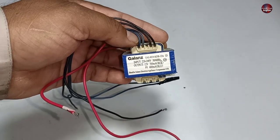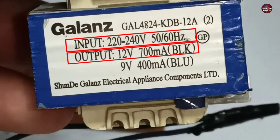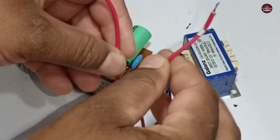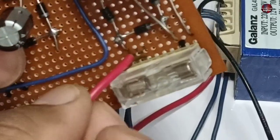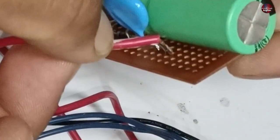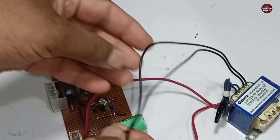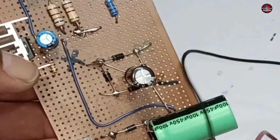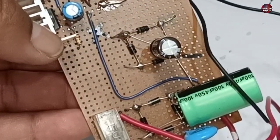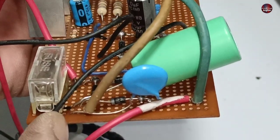The next we need is a step-down transformer, which decreases the AC voltage from 220 to 12 volts. The red wires of the step-down transformer are the 220 volts AC supply. I will install one wire in between the fuse and the bridge rectifier, and the other wire with the neutral point of the AC supply. Now I will install the 12 AC volts wire, which is black in color, with the second bridge rectifier AC supply point. And the other black wire with the next AC supply point. Now as you can see, I have installed the power wires with the 220 volt AC supply.